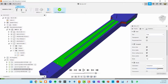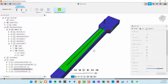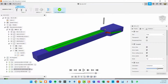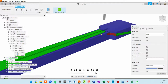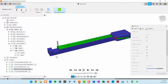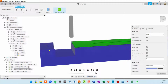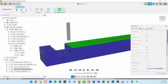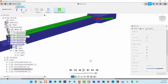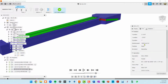That did the little index holes here so that we can see what's going on this side. That's our truss rod slot and truss rod access. That's the very shallow contour around the neck. This is the one I really wanted to see from the other side because I want to make sure that this area is preserved and isn't going to snap off the same down here when we eventually cut that roughing area. So we're still on, let's open up info and see what we're on.